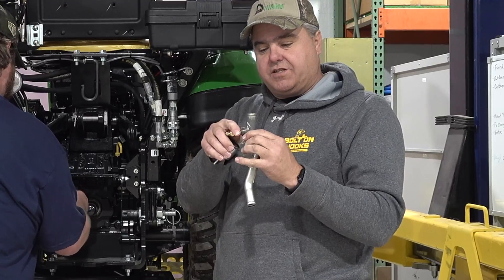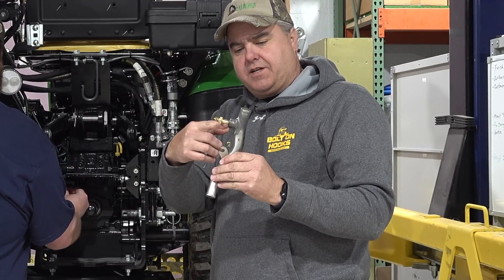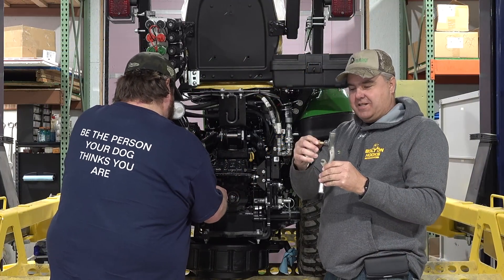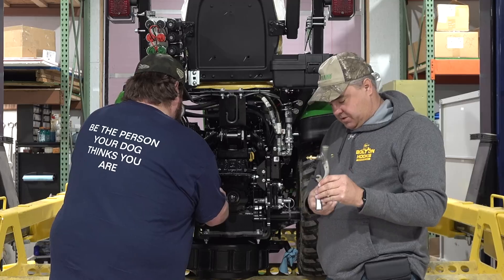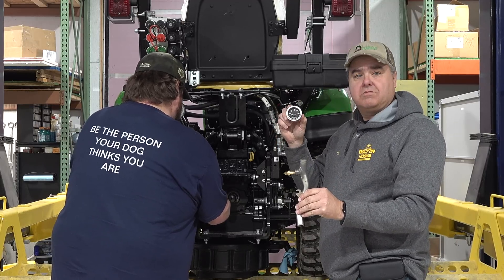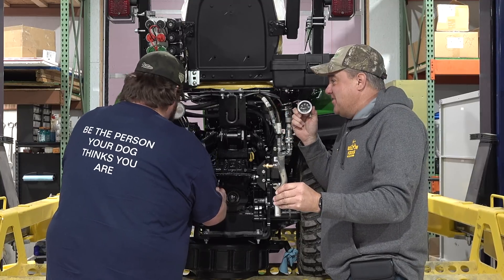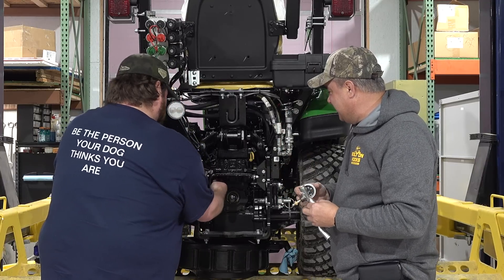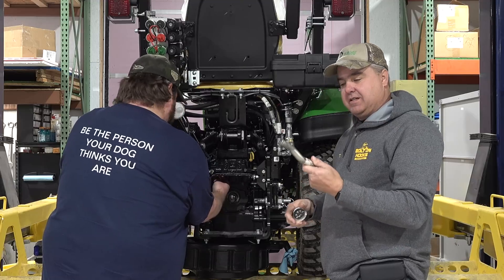Because you really can't have the temperature sensor under pressure. He's welded a little piece on the intake tube — called an NPT bung — and this is where the temperature sensor goes in. On the other end, which will be up on the dash, is the gauge. Those are the main two pieces to the whole thing. It does require the modified suction tube, which is the tricky part.